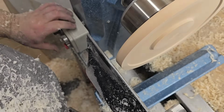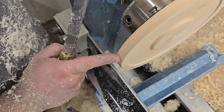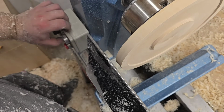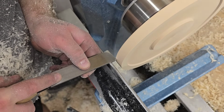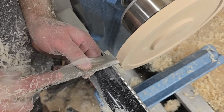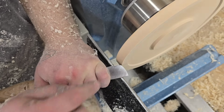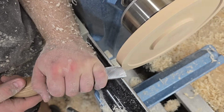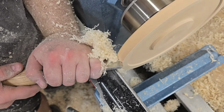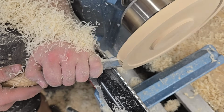Because if it does catch all the edge at once, with the pulled burr, it can snatch. Again, really nice and clean surface. You can do the same with the refiner. Now, refiner edge has one benefit. The profile here is when I tilt it up on its side, now I can introduce a whole different angle of approach, and you can see I'm getting really lovely shavings, but the angle of attack changes to the timber.